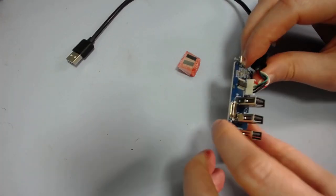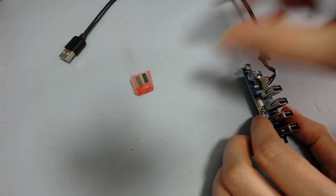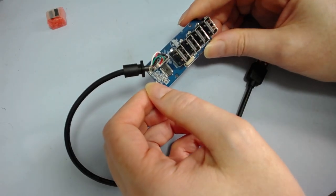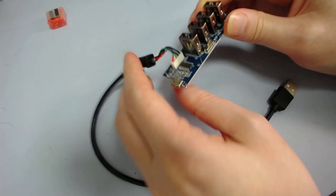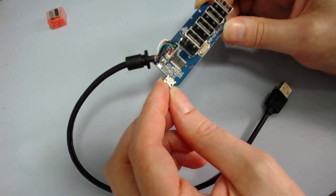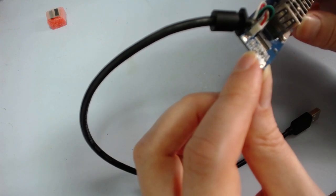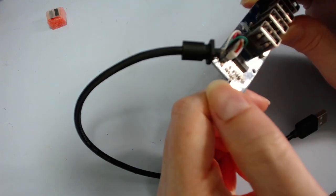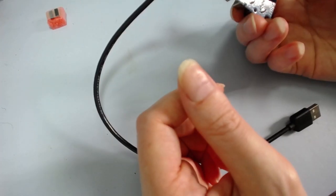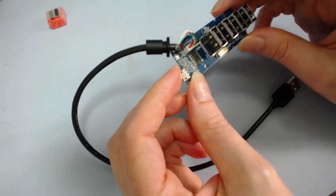There is a datasheet I found for it. I'm going to obviously try and replace this chip and hopefully see what happens — it would be quite useful to have. It's just a USB 2.0 hub, not particularly worth much, so most people would probably just buy another one, but why not try to fix it? It looks like the only thing wrong is that the chip has blown up — there's no other active circuitry I can see. The fuse is still good, hilariously. There's a zero-ohm resistor where I think there should be a diode for reverse polarity protection, but it all seems fine. The pins in the sockets aren't bent.